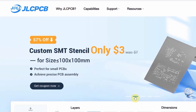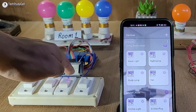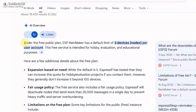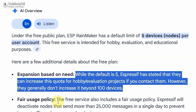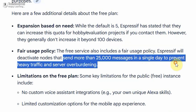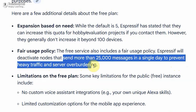Here you can see they provide all the services related to PCBs. For more details please visit their website — link is in the description. In this video for the demonstration I will connect two ESP32 with the same Rainmaker account. But if you are using their free plan, you can connect up to five ESP32 nodes with the same Rainmaker account to control different appliances. However, I will not recommend connecting sensors with the ESP32, because the sensor will continuously send data to the Rainmaker server which will exhaust your free limit. In future they may change their free plan policy, so please check their website for future updates.